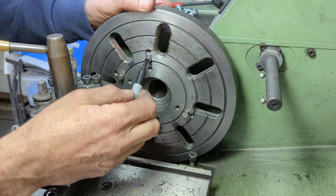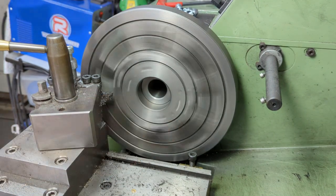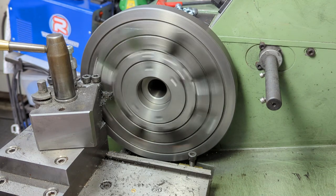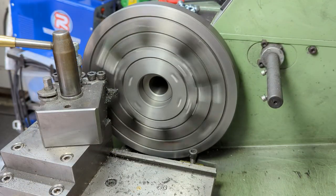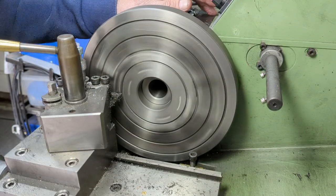After fitting the faceplate into the lathe, I add four M5 bolts into the latter group of holes with lock nuts, and then face them down. The intent here being to generate a set of reference faces that are perpendicular to the lathe axis.